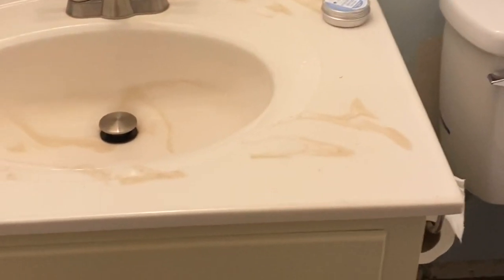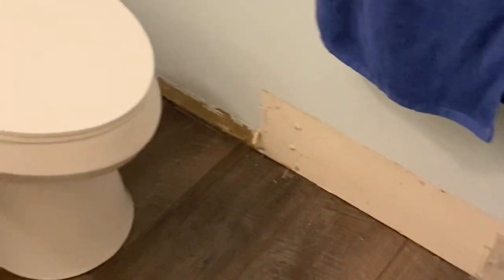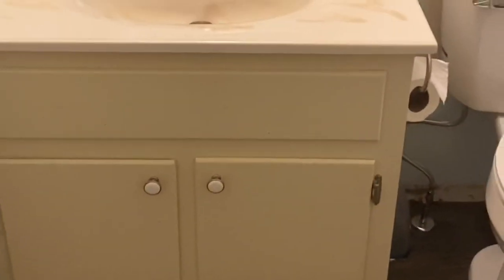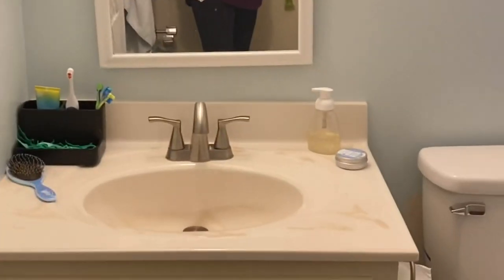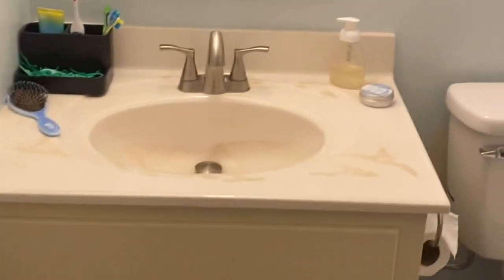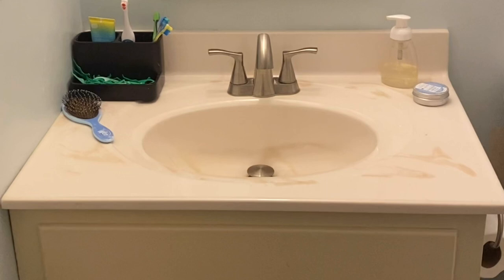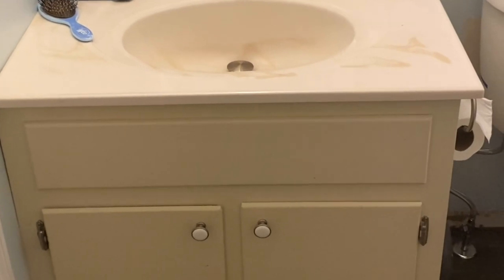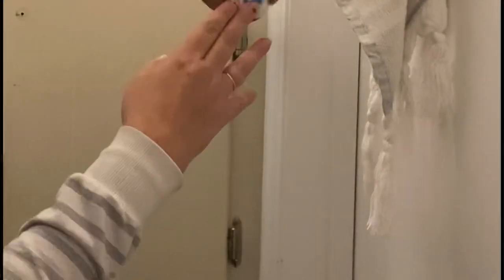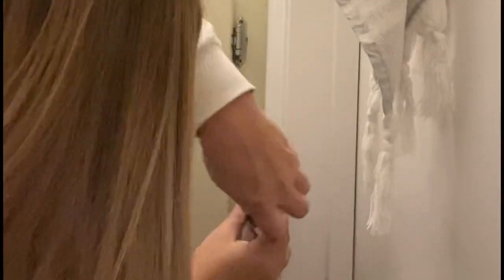So much got done today, which is so exciting. Now, I was originally ready to paint this vanity the same color that I was going to paint the top of the wall, except in the shower. But I'm thinking I might use what I have on hand and just get started on the vanity right now, because I'm itching to do some more. This surface was previously painted, so I sanded it down really well first before I started with the paint. Then I made sure to clean it off really well so the paint would stick, removed all the hardware and all the doors, and then I could finally start painting. All the prep work is really worth it for a good finished result at the end.